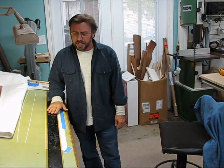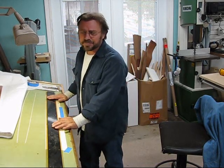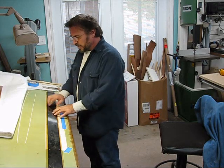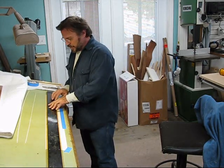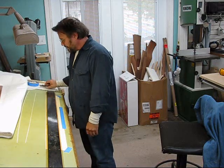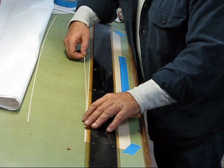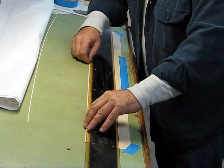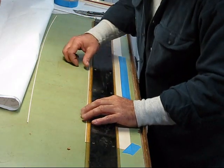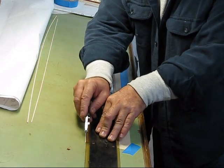My method for cutting the purfling lines consists of using a drafting table with a parallel slide on it for cutting the strips. I pretty much just take the veneer strip and tape it down so it doesn't move, slide the parallel strip to the width that I want, and then cut it with a sharp razor knife. I have one strip I already cut to the width I want, and I use it as a scale to lay on top and then adjust my slide. That looks good.